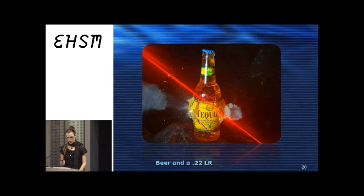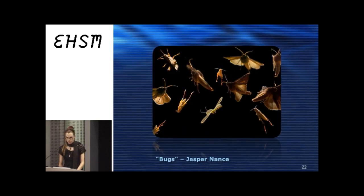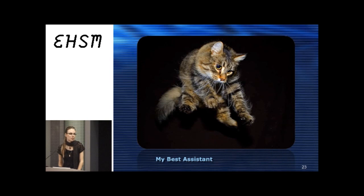There's also an infrared beam I used — a television receiver with 44 kHz demodulation and a 44 kHz strobed infrared LED. This does not work for high-speed photography such as bullets, but it consumes less power, is less tricky to set up, and you can hike around with it — I put it in my backpack for camera traps. It works really well for things like bugs because bugs don't move very fast. I can also trigger a normal low-speed flash with this setup — even for my cats, since I don't want them near a high-voltage source or a laser hitting their eye.